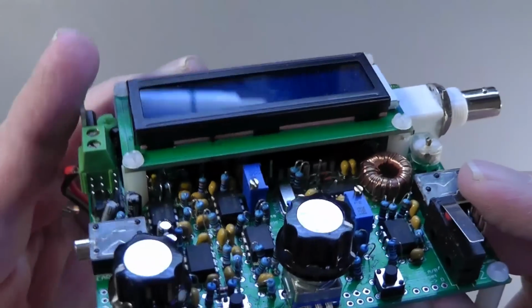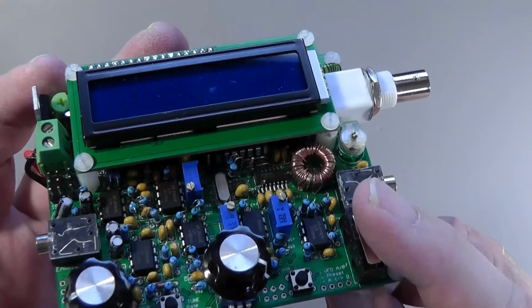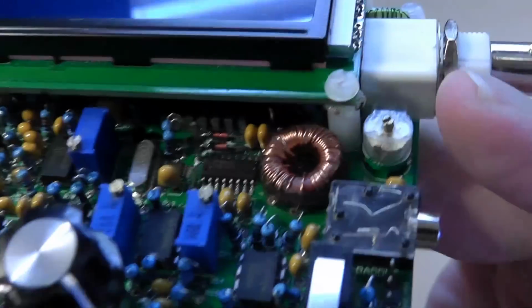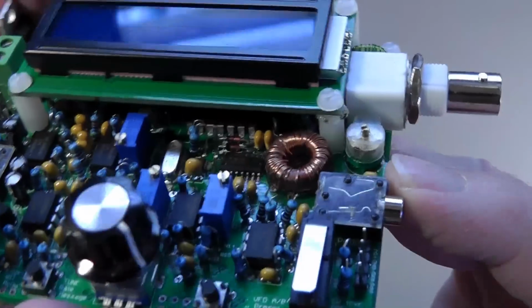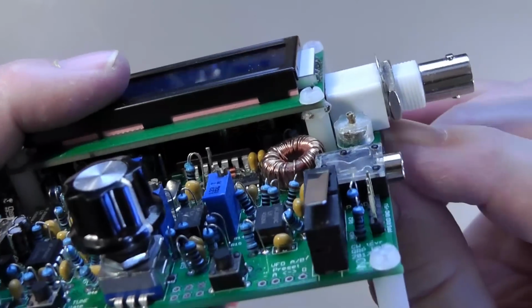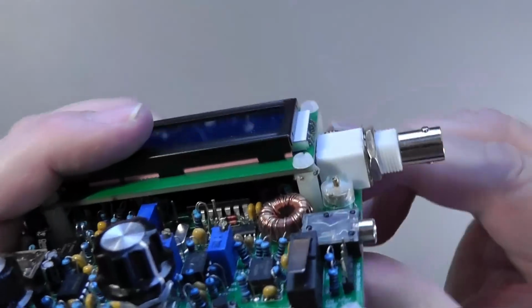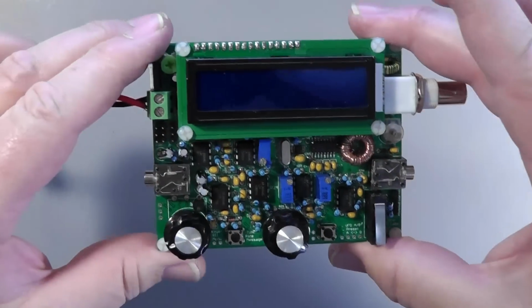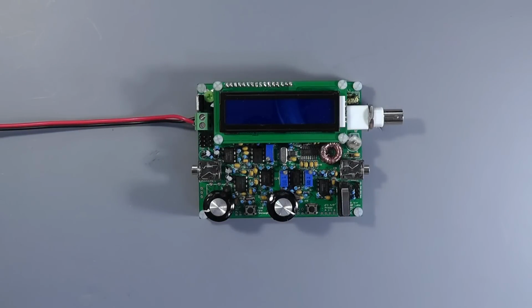All of the attempts at closures that I've seen on the internet ignore the straight key feature, which is a shame. Note too that the two stereo jacks have no threads for panel mounting, so the panel needs to be flush with the circuit board on both sides. Yet the BNC connector had to be mounted about 2 millimeters out of line to clear the display board. I hope that some entrepreneur comes up with a design where the circuit board, as it stands, simply drops right into an enclosure. Okay, on to operations.